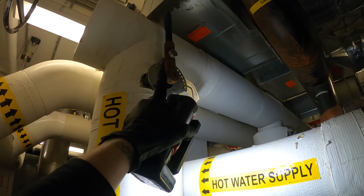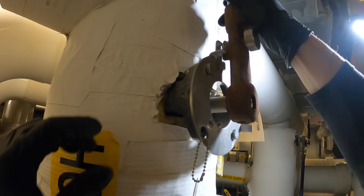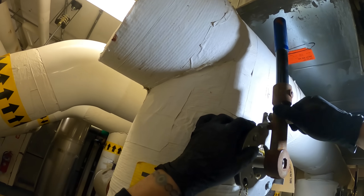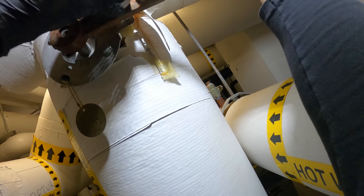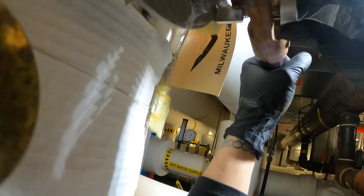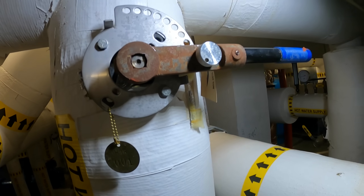And then the return — there's another valve here, so we're going to close both valves to isolate the water circuit. Here's our isolation valve. There's a pin here — you can pull this back and turn the valve. It doesn't go any further, but that should be closed. It doesn't seem to lock. Anyways, this will be closed on this one — hopefully that holds. It's no longer parallel, it's crossed — that one's off.